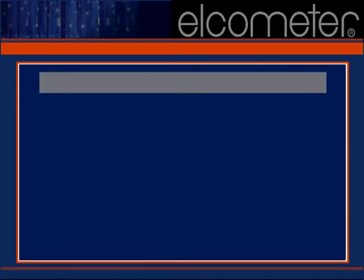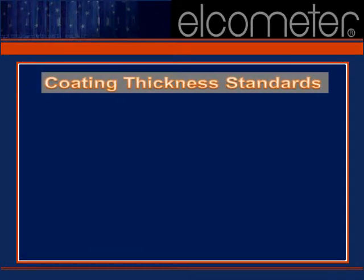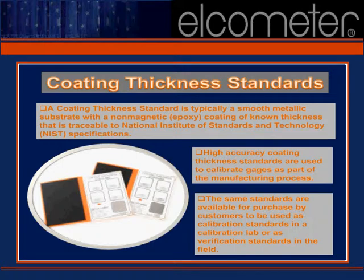Coatings thickness standards provide a field-ready model of the paper-based standard provided by the world's leading authorities on coatings thickness measurement. Pre-coated standards, using hard-wearing epoxy coatings on both steel and aluminum plates, are available. Sets of pre-coated epoxy coating thickness standards are supplied in binders with a zero plate and four thickness values together with a calibration certificate.